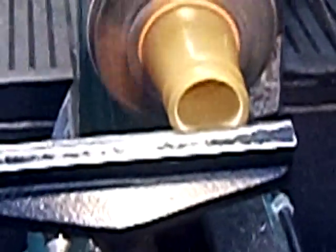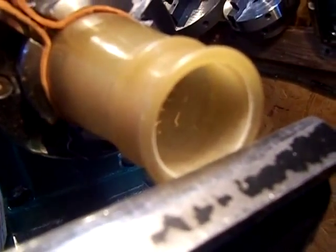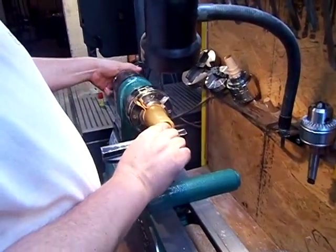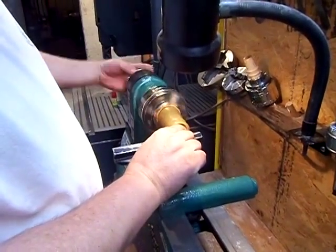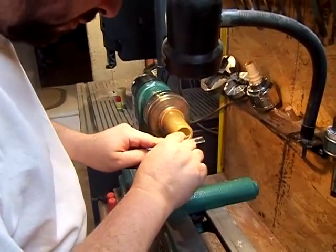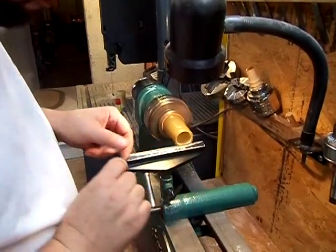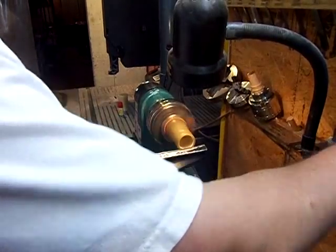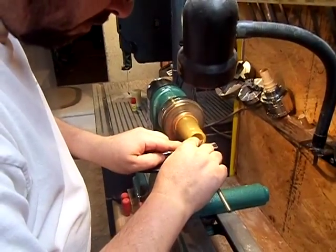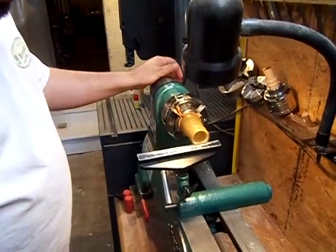Right at the base of our ramp, for about a sixteenth of an inch depth. You'll be able to smell this. Then I'll hand spin it to finish the groove. I'm going to broaden it just a bit with this second tool which is also 60 degrees but it's squared — there's no relieved edge. And you'll see I have a nice deep groove.